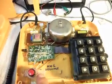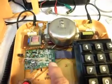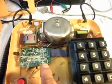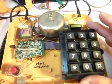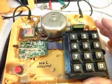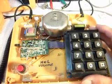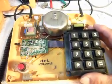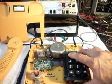This switch was always located at this position, but it has a different switch in it to turn off the bell. This is the new board that we installed and incorporated with all the old workings and the old board, and then our keypad is back in place, and it is all back together again and rebuilt. And we showed you in a part 3 video that this keypad had to have a board installed with 12 momentary switches so that we could get our dial tone, our dialing.